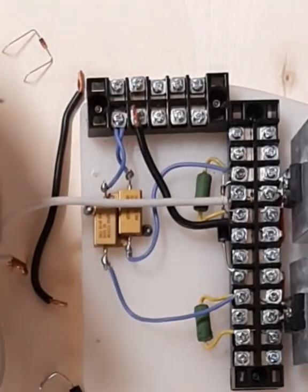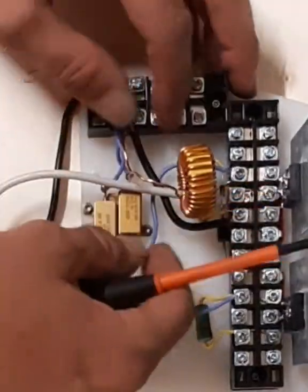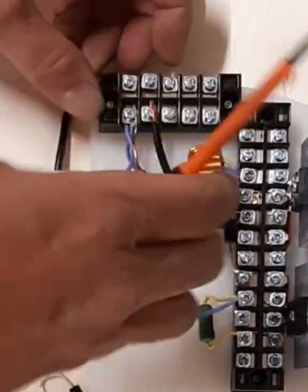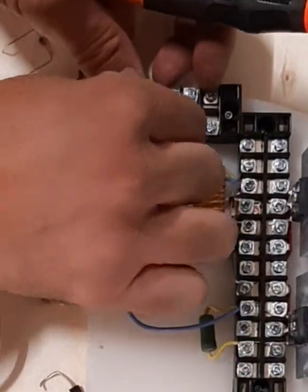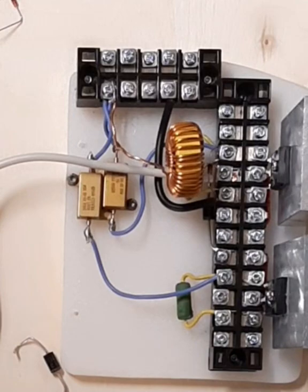And this is one of the outputs to the Tesla coil — the white wire — which would go to your primary. And your inductor goes on the same, which is your drain. Both of the inductors go to a common source, and that just came off of a standard ZVS driver.